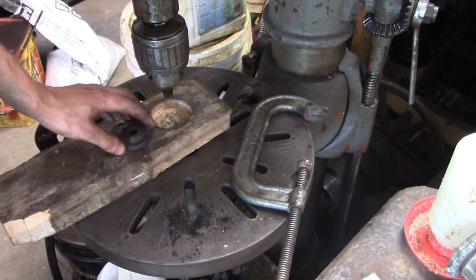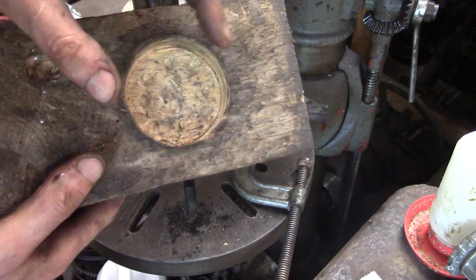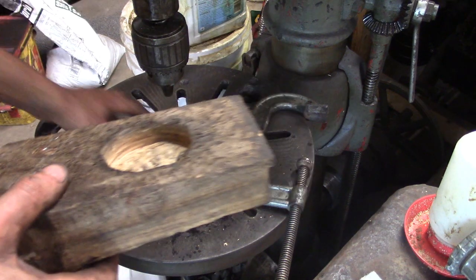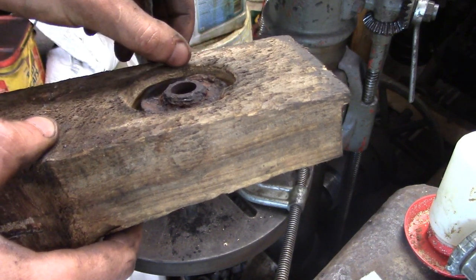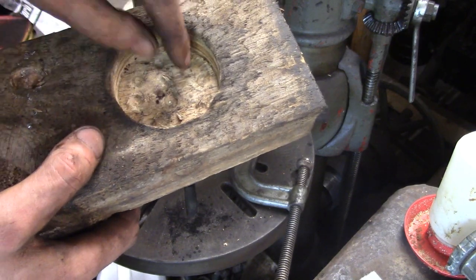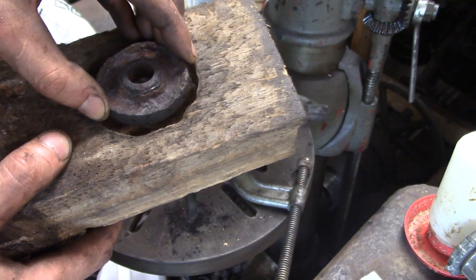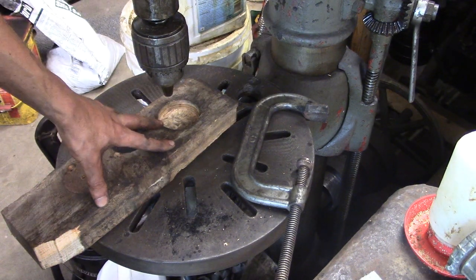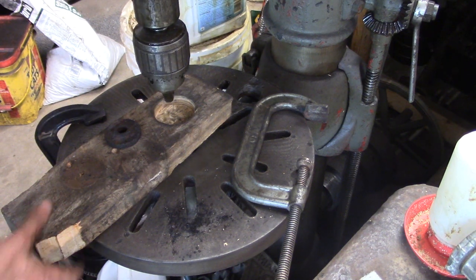This is the form I made to form the leather in. The bore of the cylinder in the pump is two and a half inches, and as it turned out I had a two and a half inch hole saw. So I took a big chunk of wood, hole-sawed down a suitable amount — at least as deep as the seal support plus a little extra. Then I drilled a bunch of holes to the same depth, pried all the pieces out with a screwdriver and finished with a chisel. There's the form — this is the male and this is the female. I'm using my big Camelback drill press as a shop press, though you could also use a bench vise, heavy weights, or a shop press.